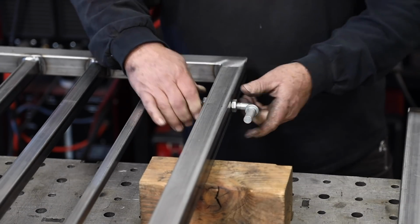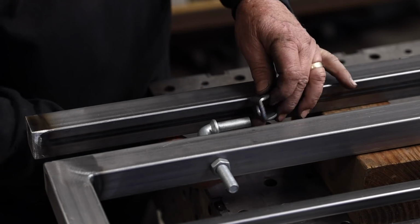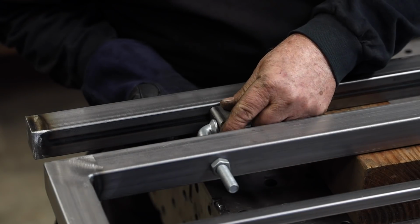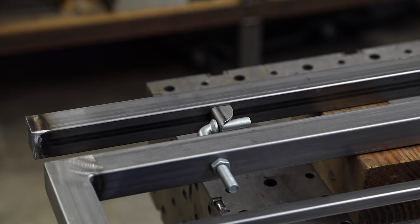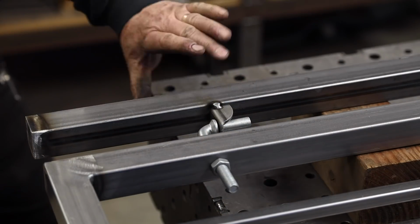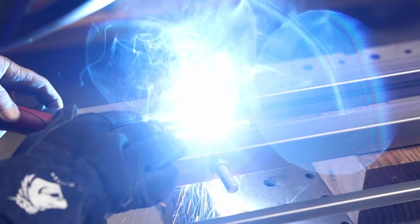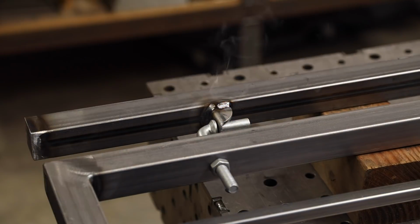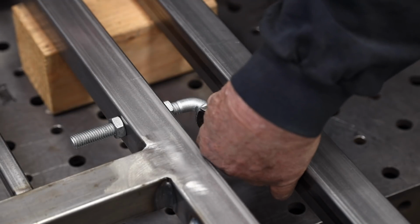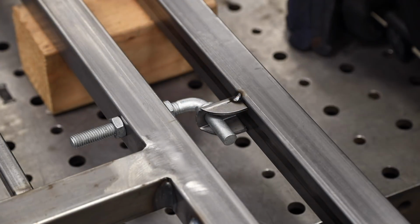All right, so here's the hinging system I was talking about. It's just a 1/2 inch bolt. These are pretty common back in the day, and this was what was existing, so I'm just matching that. It's not the ideal scenario, but it does work pretty good. Pretty common. You can find these in most places. It's a simple procedure, provides a lot of adjustment and being able to open the gate or close it. You can see how much thread there is there. That gives you a lot of space to open and close the gaps if the wall moves over time.